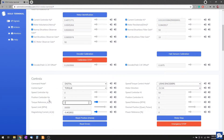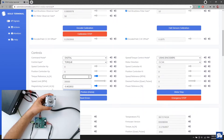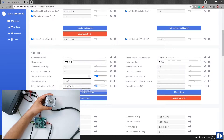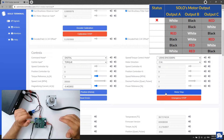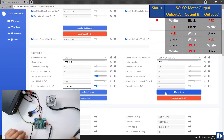I give 2 amps as the torque reference and the shaft is blocked — the motor doesn't move. Even increasing the torque or changing direction doesn't help. This is a clear sign that the motor wiring is incorrect. I stop the motor, discard this combination, and move on to test another one. Out of six combinations, only one or two will work.